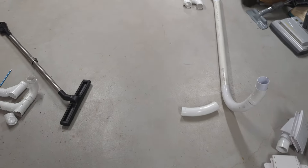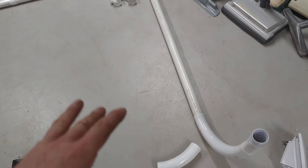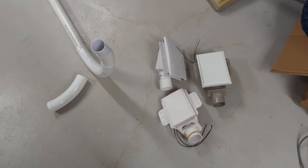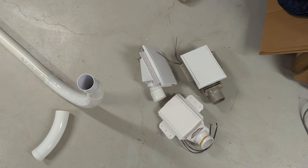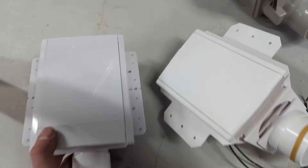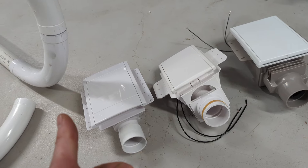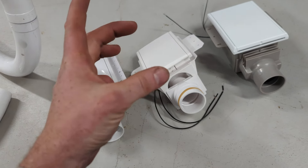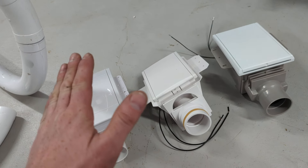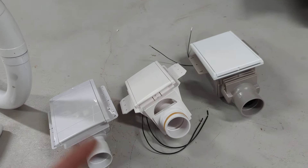In fact, the piping system is the same — the same kind of elbows installed with the same principles. The differences between those brands have to do with the valve itself, which is the termination point of the piping system. The valve has to do three things: the first is to activate the system, the second is to lock the hose, and the third is to seal the opening when the valve is not in use, so that there's suction throughout the rest of the system.